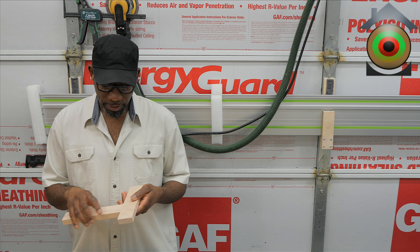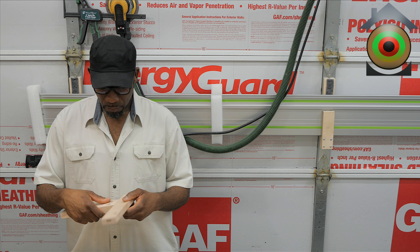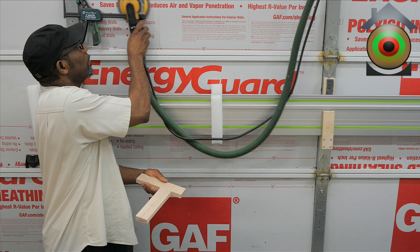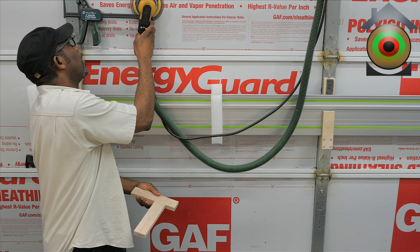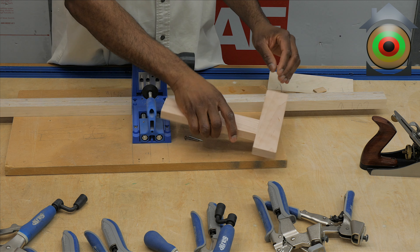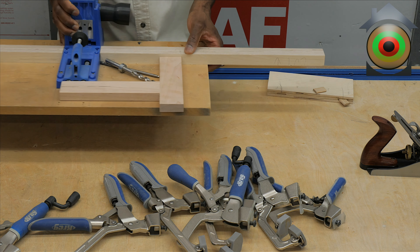Now the love comes in after you make this joint — there's a high probability that you're going to have to finish the joint. When I say finish, there's going to be more treatment done to it. The joint is not going to be flush; it's either going to be slightly proud on one side, as in a little twist, or misaligned up and down. As you can see in this one, this face is flat, but this face is a little bit proud on one side. This is flat only because I made it so, by either sanding or with a hand plane.